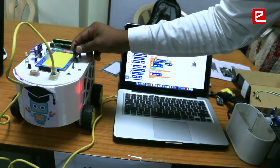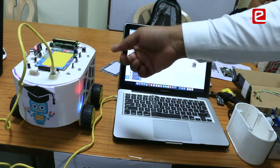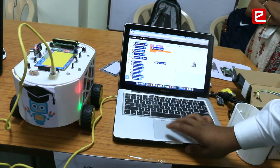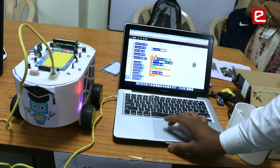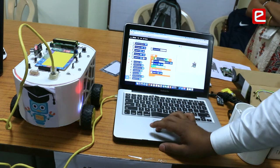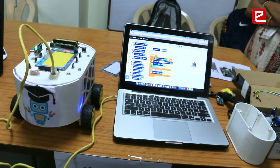I plug the fire sensor into the 3-pin port. The fire sensor block returns a value of 1 if there is no fire and 0 if there is a fire. I implement a program: if it senses a value of 0, it will display 'Fire Detected' on the LCD, say 'Alert, fire detected' out loud, and if nothing is happening it will say 'All okay.' Right now it's saying 'All okay' — now my teammate puts a flame near it and it says 'Fire Detected.'